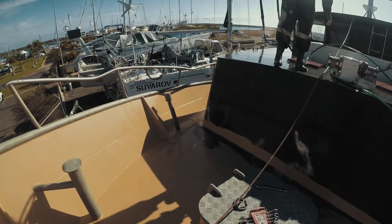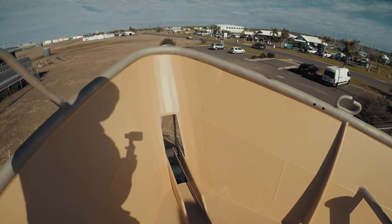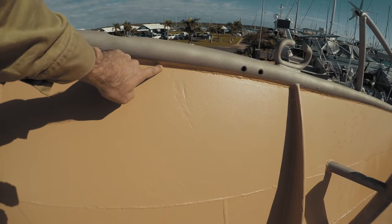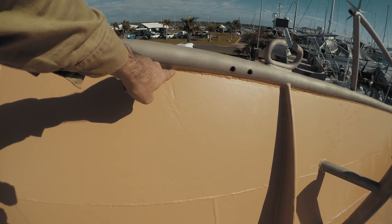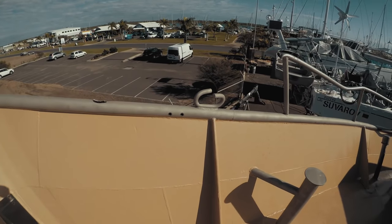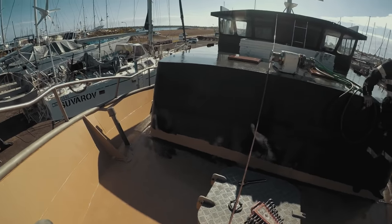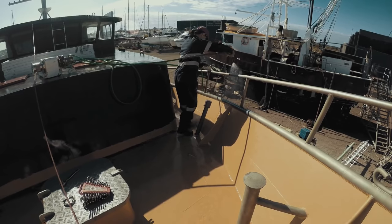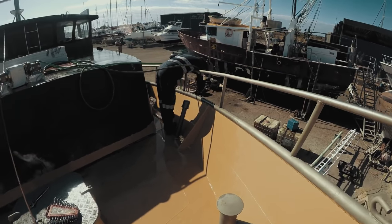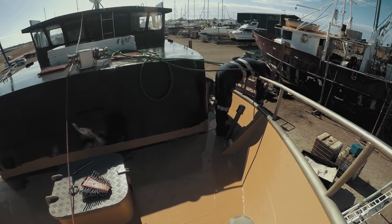It's the first time we've been able to have a real good look at the bow up here. You can see all the way around there's a lovely thick coat of etch. This is stainless and this is mild steel with a weld joining the two together. We paint up and over the weld because the molten mild steel in that weld will rust even though it's a stainless wire. We've still got another three layers of paint to put up here — one more etch and then two top coats. We'll leave the top coat until we're just about ready to launch, then sand and apply it, since ongoing welding and grinding would just ruin the top coat.